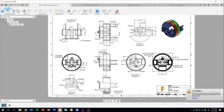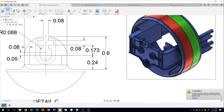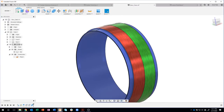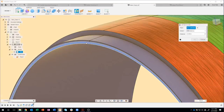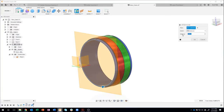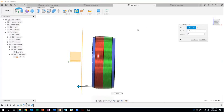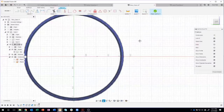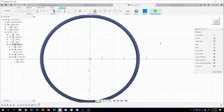Now we're going to work on the front region. Everything is on the drawing. I'm going to start basically 0.8 inches from the front of the ring. Let me do an offset plane — I'll click this front plane and offset 0.8, just like it showed in the drawing. You can see it's going to start from that front face and move 0.8 forward. Then I can start to create my sketch. This is a fairly symmetrical part so I'm going to draw half of it. We're going to cut this down into smaller components and then combine them together, instead of trying to do a really complex sketch.